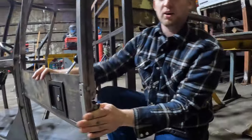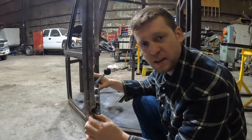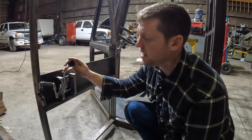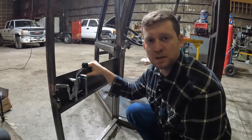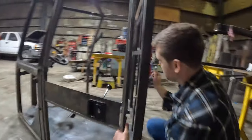Little things like this on the end — come have a look here. Instead of recessed Phillips screws, standard bolts. You can get a wrench on these, pull them out if you need to access. On the back here there's no cables — it's straight mechanical linkage. That's going to give you the best connection, best serviceability, fewest things to go wrong. Simple mechanical handles — that is the way to go.